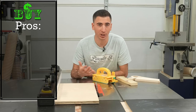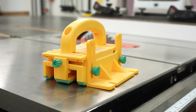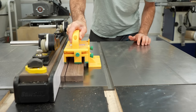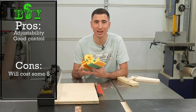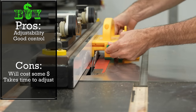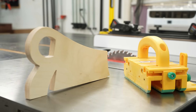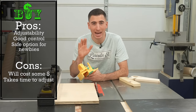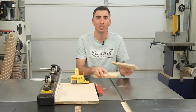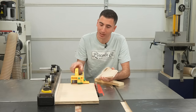So what does buying a specialty push stick get you? For $60, you could be the new owner of this yellow beauty known as the Micro Jig Gripper. It can do everything the DIY version can plus much more. I can adjust the legs to give me full control in between the fence and fully support the off-cut, plus there is a stabilizing base plate for taller pieces. The only downside aside from the price is they take a little time to adjust, which can tempt you to say 'I don't need this — it's just one cut.' But your life can change in a fraction of a second. I encourage any beginner to make room in their budget for this or similar items. Let's take a stance: this is a buy starting out.